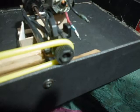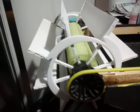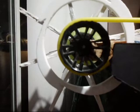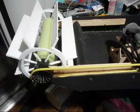a homemade pulley. And the homemade pulley is made from a washer, and what you see there, that gear, that came out of a differential for the RC truck. Back here, the big pulley that's driving the paddle wheel, that's actually the wheel of an RC truck that's been cut down. Now, finding a belt to drive this thing was a bit of a challenge. This is actually fuel line. Yep, for nitro fuel. And that's the latest update.